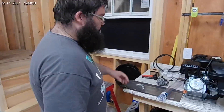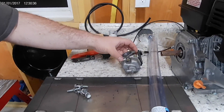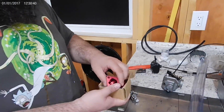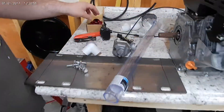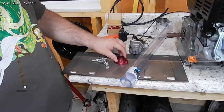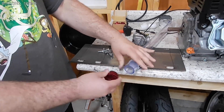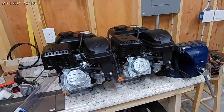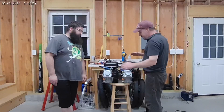We've got a single Mikuni-style carburetor — it's 26 millimeter. And we also have custom fittings — some modified intake manifolds. We've actually cut these manifolds so that we can use tubing and fittings to tie two into one. Basically we're going to have the intakes one on each of the engines and the tubing coming off of both engines into a T-fitting and into the single carb.